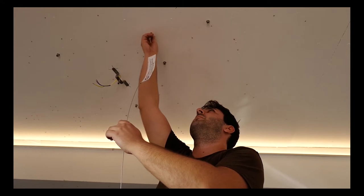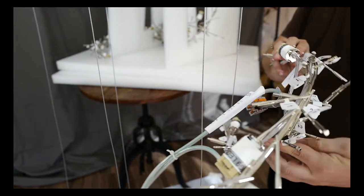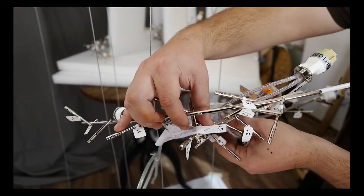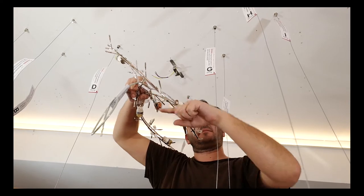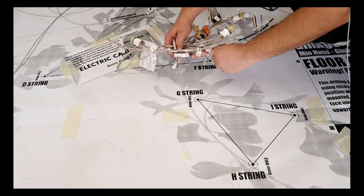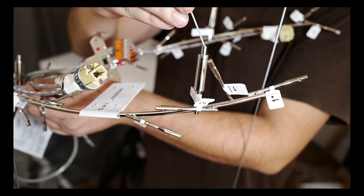Now you need to take the metallic frame out of its support foam structure. Pay special attention while doing that, as many metallic elements are fragile and can be damaged easily. Examine the metallic frame and locate the three holding mechanisms fixed on the metallic frame. They are labeled with letters A, B, C and so on, corresponding with the letters A, B, C from the drilling pattern. The metal hanging wires are also labeled with the letters A, B, C. Please be sure to match all the letters of the wires with the letters of the holes and with the letters of the cable holding mechanisms.